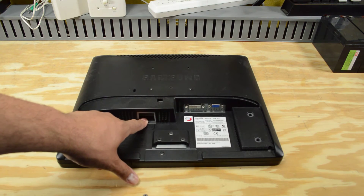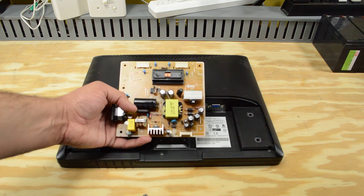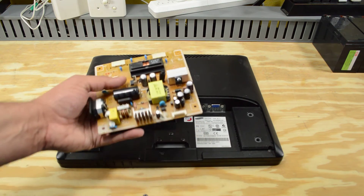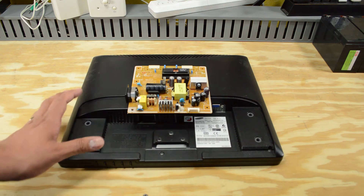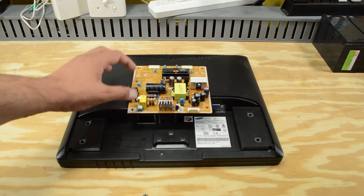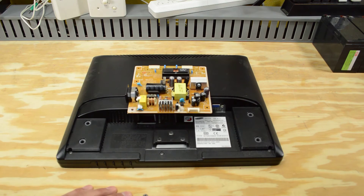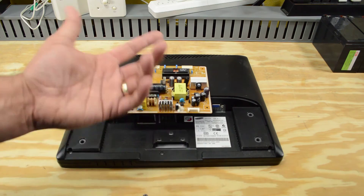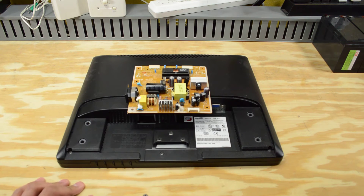On the bottom here you'll notice that the power plug is gone, because I actually took out the board from inside the monitor. Based on some research I did related to the problems I was seeing, they always sort of led to blown capacitors on this board. None of the capacitors here look bad, but it is an older monitor and a couple of them are the cheap kind, so we'll see. I did order some new ones and I'm going to replace them in this video to see if that actually fixes the problem.